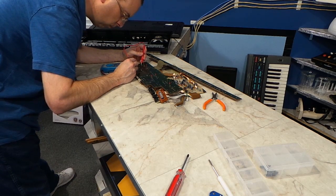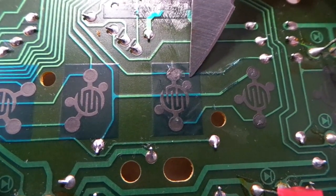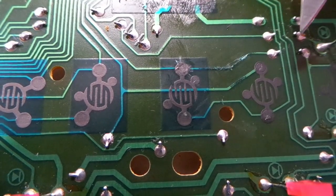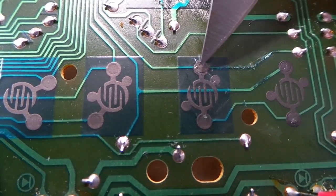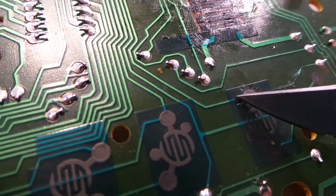I started poking around with my voltmeter trying to figure out where the traces go. What I eventually discovered was this section right here was actually non-conductive — it has actually been eaten away by some corrosion, possibly as a result of whatever this stuff was on the pads. My guess is it was something probably dropped in there during manufacturing, and it probably took years to eat its way through those traces. My plan is to run a jumper wire from here all the way to here. This will get all of the rest of the buttons working, but as for this one right here, I'm going to try to scrape this stuff away and solder directly to it. I tried several times to scrape it, but I was never able to get solder to stick — I think all of the copper was just eaten away, so that button is simply non-repairable.